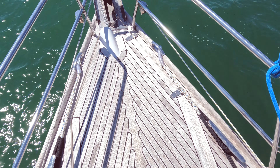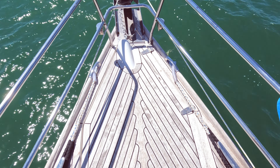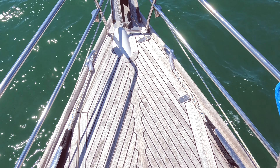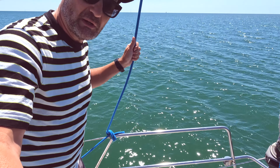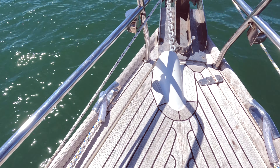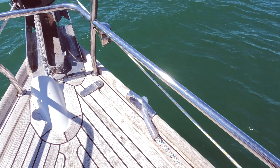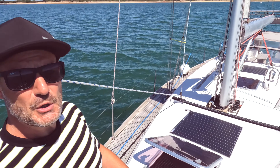Looking at the floor, we've got a teak deck. Teak is a fantastic product for boats — it wears really well and is fairly low maintenance, though it does wear away. I don't know if I was choosing again I'd perhaps go for a fake wood, but this is traditional teak, which is a traditional thing you aspire to have on your boat. The ropes from our cleats go through these fairleads — metal fittings on the front that hold the rope in a really fixed position, though they are a bit of a pain as you have to thread your rope through every time you're mooring.